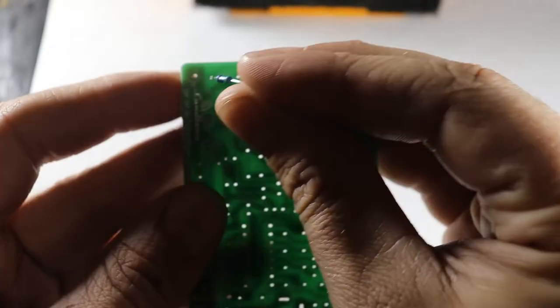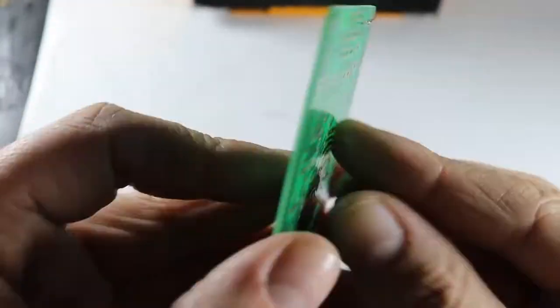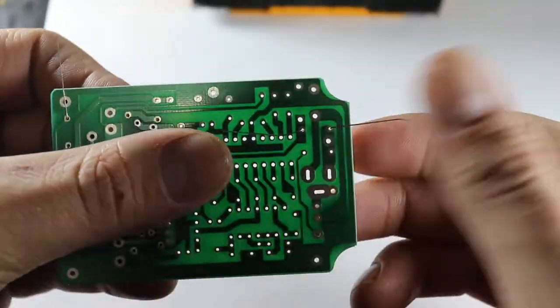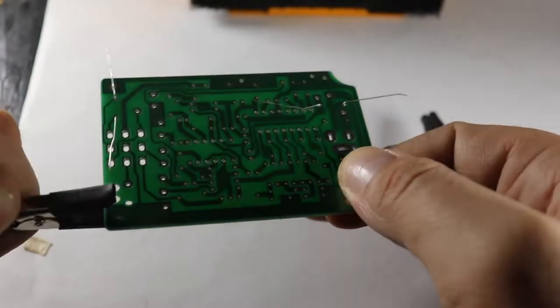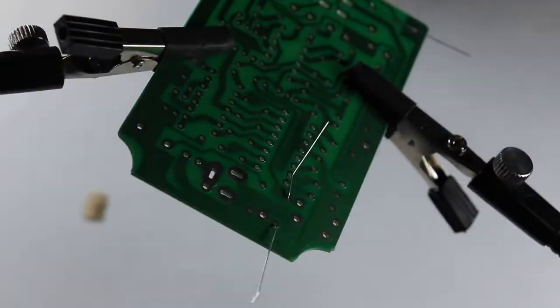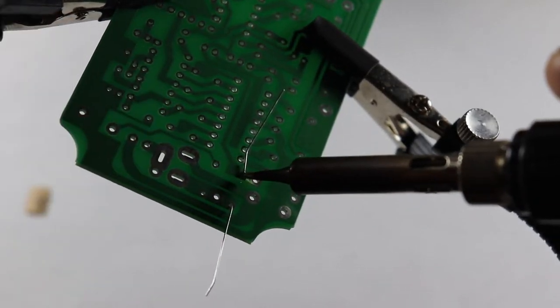We could literally start anywhere, but I'm choosing to begin with the resistors. It's been a good several months since the last time I soldered anything, and I want to start with something easy that I have replacement parts for. See, some of these parts in the kit we need to be very careful with, but resistors don't have any polarity, which means it doesn't matter which direction they're installed.